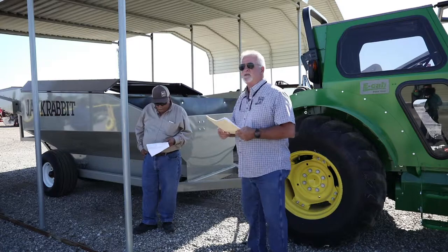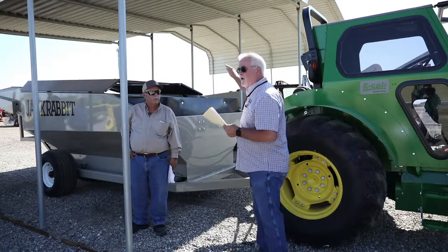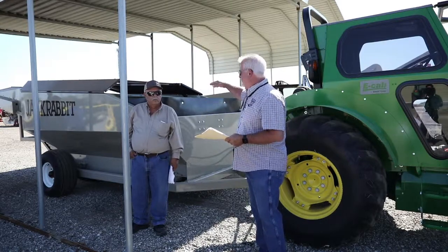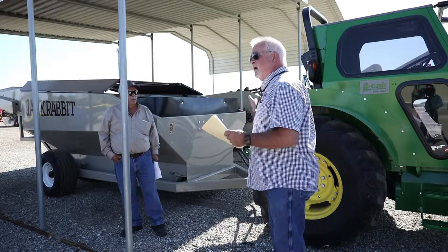One other thing that does is when you're going through the field and if you hit bumps and that sort of thing, it keeps the elevator of the harvester from dipping into the augers, okay? That's a safety issue too, because you'll tear it up and then you have to repair it and that sort of thing. So never ever stand between the cart and the harvester.